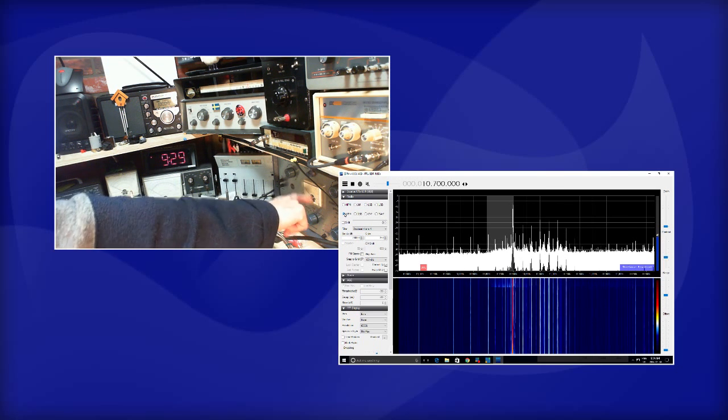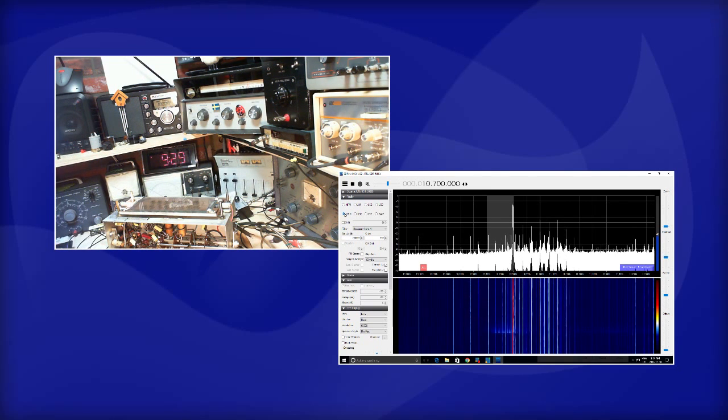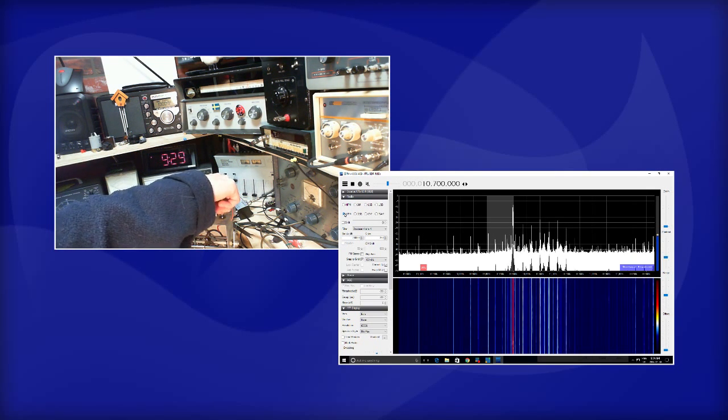That's great. So it turns out that the control I'm turning here is calibrated perfectly, and when I have it set to 100, it really does produce 100. Now you can see the IF now is running at 10.8, which means the radio's not tuned. Tune the radio now.